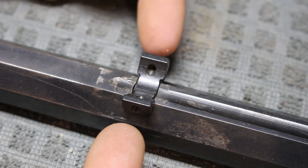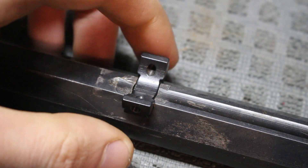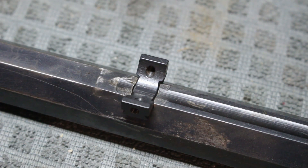The two screws come into these holes right here, and these holes strip out because there's too much movement to one side. You'll strip out the threads on the tenon, and then on the other side when you try to push the screw in more, you'll strip the threads in the screw. What I have now is a new tenon that I ordered online. This rifle is approaching 150 years old, so it's normal that the specs aren't totally the same, but I'm still pretty happy it's almost a drop-in fit.